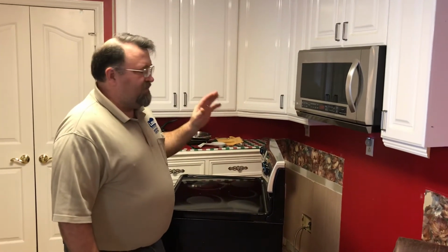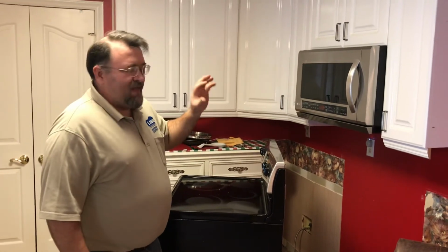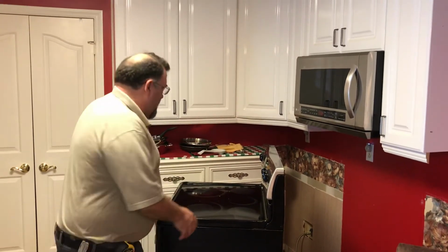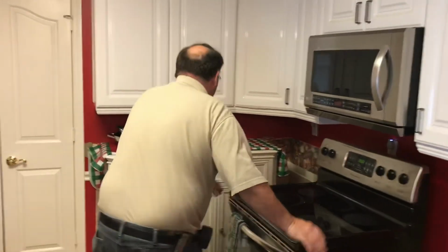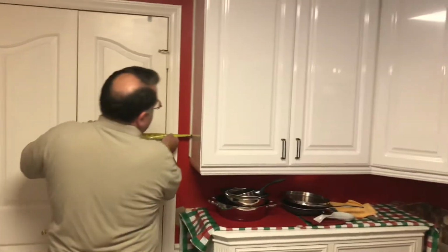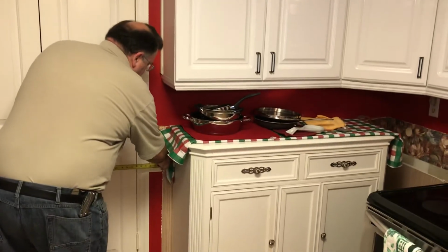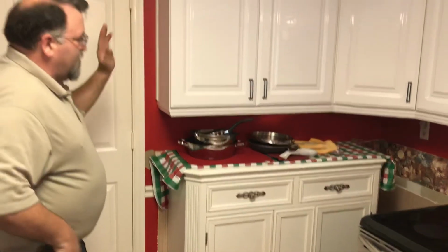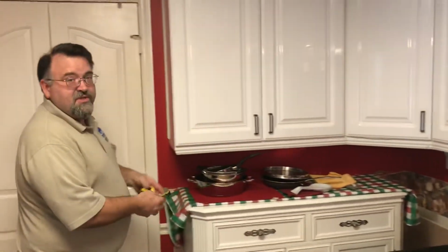So that's just some idea of the numbers I'm giving you on the design, to make sure that those numbers match up with the layout of the cabinets. When you come around this corner, at this side of the room, the cabinets come up to this door trim with about a 3-inch margin, 2 3/4 inch margin. On the bottom, it was around 3 inches as well. So the cabinets run for this length of wall is right at 60 inches. It's 60 inches of cabinets.